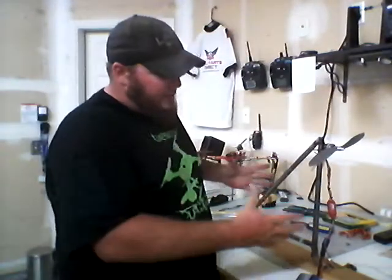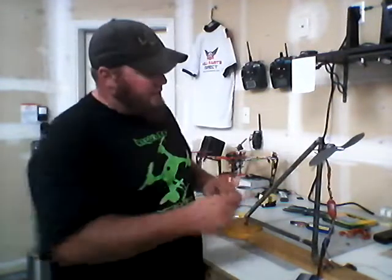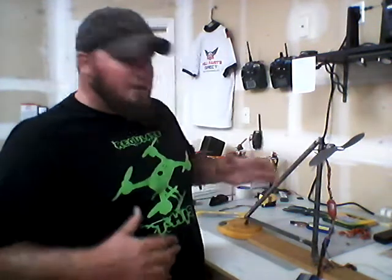Basically what I've got is a metal framework that has a pivot point down here, goes onto the scale, you've got your thrust load up here, and you're going to transfer everything down to the scale so you can get a reading on what's going on. The basic framework is metal — FlightTest made theirs out of wood. I've got half-inch by half-inch booms. It's really whatever you have available. The dimensions can change, with the exception of the length from here to here and here to here — those need to be equal. In the case of this one, they're 14 inches, and that's just so that you're transferring that force evenly.